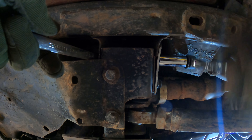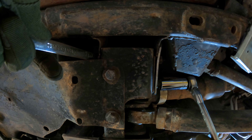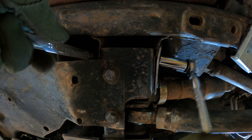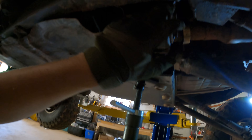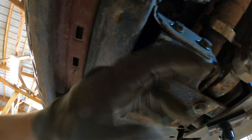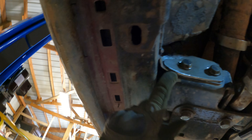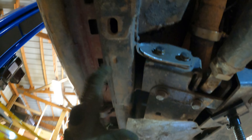Slowly tightening these bolts — it looks like it's going to almost start bending the brackets, so let's just see what happens if we keep going. I'm extremely confident with how this turned out now that we just kind of sucked the bolt in tight. You can tell we didn't go too thick on the bracket, so it curved with the natural bend of the bracket. About 3/16ths is actually the perfect amount. We tighten these down, it curved, and it did for the most part suck it back in. Now we're just going to go ahead and weld a few spots on this, then grab our gusset and gusset it over here so we never have to deal with this again.